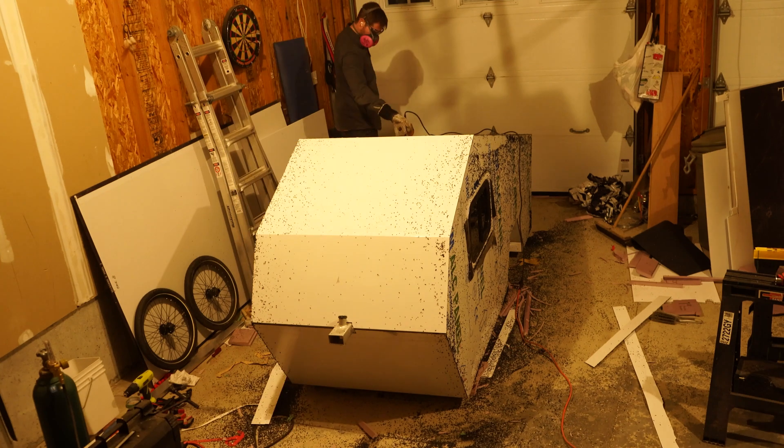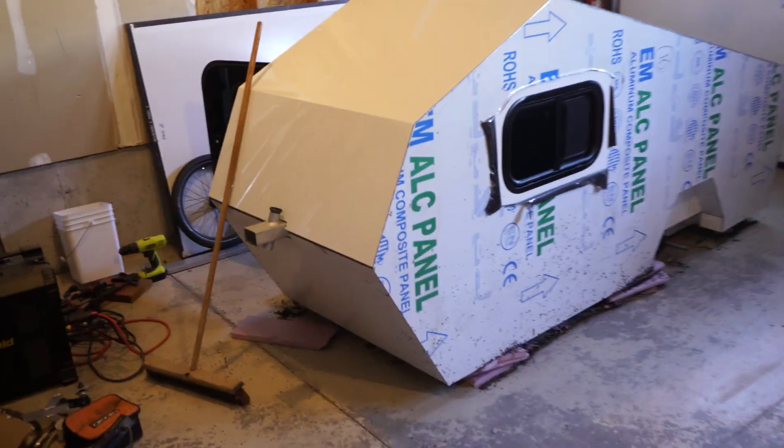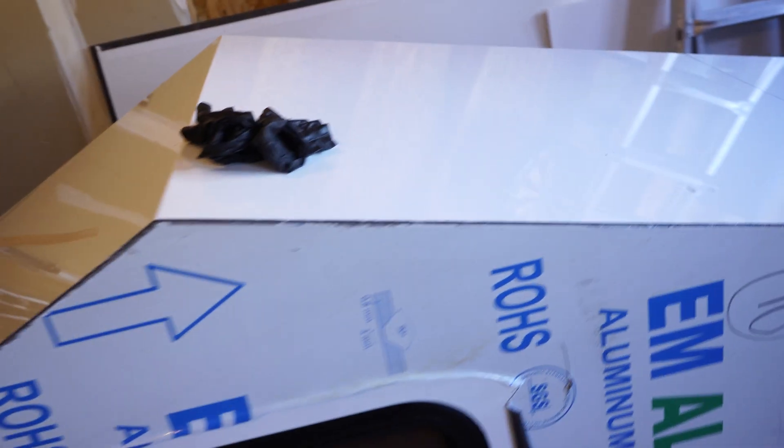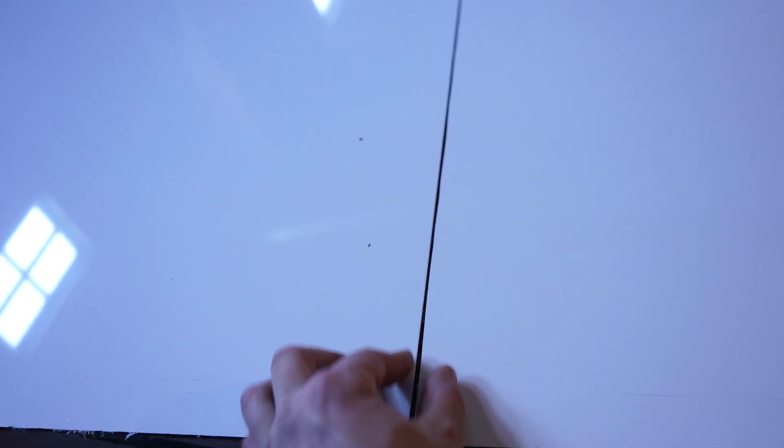And there at last is the shape. Just doing a quick walk around with the roof on, using some acetone to clean it up. Here's the seam — I did it there so that I could have a nice smooth fold, so that's going to be waterproof. That flat seam I'm just going to put some tape on. I've got 3M tape on a three-quarter inch cross member, three-eighths on each side. That 3M tape is completely waterproof, so even if some water gets underneath the tape I put over this, it shouldn't be able to get in.